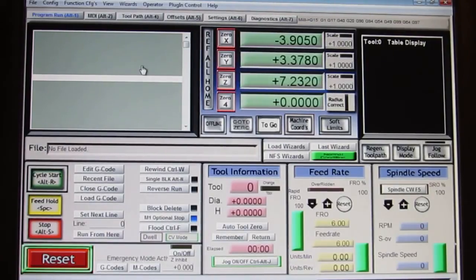But with a little exposure and a little common sense, I've developed some perspective as to how to, quote, tune these motors. And tuning is nothing more than selecting a speed, an acceleration and a velocity. Acceleration is how fast the motor ramps up to speed, and then of course velocity is the actual speed of the surface as it moves. And they interact, okay?